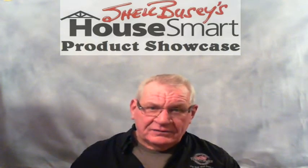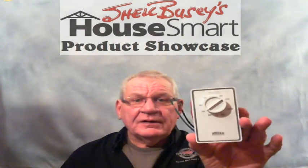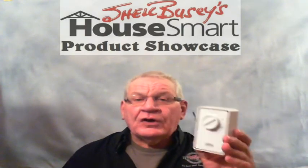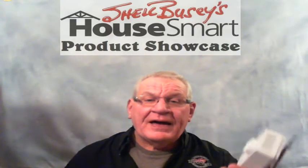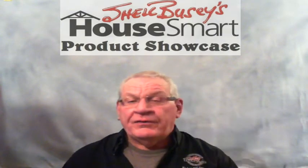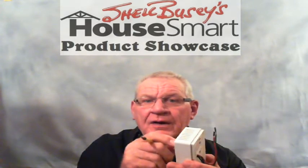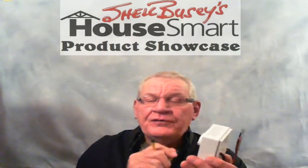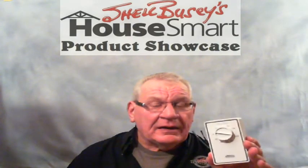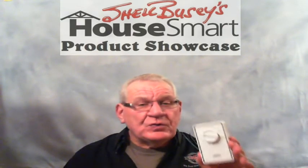With your exhaust fans — and some of you may even have this device here. This device is called a dehumidistat. The dehumidistat is hooked up to operate and control your bathroom exhaust fan, or any device that's exhausting air out of the home. As soon as you meet those set points of temperature or relative humidity, this unit will turn your exhaust fans on automatically, no matter if you're at home or not. That's what you want — to control exhaust ventilation using a dehumidistat.